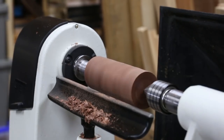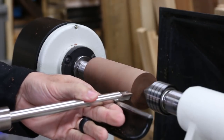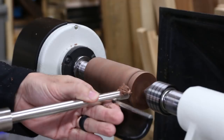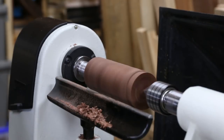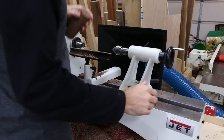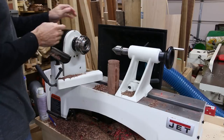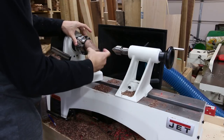I got down to a cylinder and then started cutting my tenon to fit in the midi chuck. After my failed attempts in earlier days I had a larger blank to work with today and had a good go at it this time. I removed the drive spur and mounted the midi chuck on the headstock. Having a shoulder on the tenon makes mounting the blank level a much easier task.